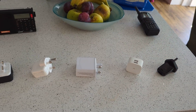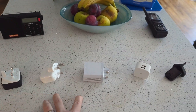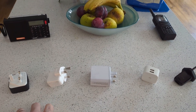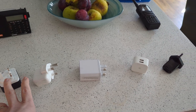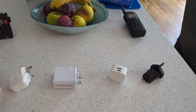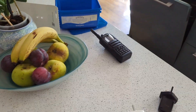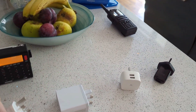The first thing is USB power supplies. These are the culprits — 5-volt switched mode power supplies. They're a problem because they produce radio signals, and it's worse when you plug a lead in because the lead acts as an aerial. I'll show you how bad they can be. I have my radio here — a medium wave radio set at 750 kilohertz — which will give us an idea.